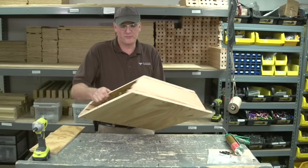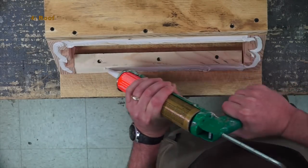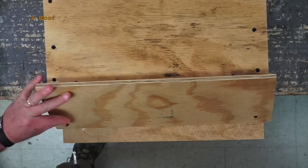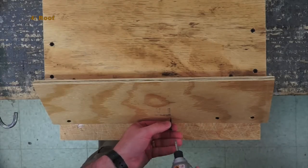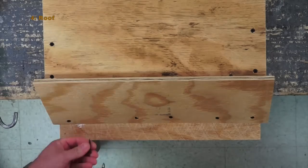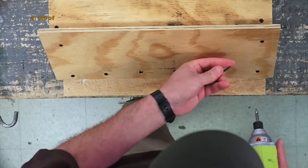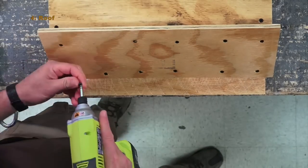Now I'm ready to install the roof. This is not a time to skimp on the caulking — we need this roof to be airtight so that the bat house retains heat. The idea is to have screws go into the back and pull the roof together tightly. Move the bat house so that it is hanging over the edge of your workbench in case a screw pokes out the back. If one does, just cut it off or hammer it flat rather than making another hole. Finish off the roof with 14 screws altogether — we need this many to prevent the roof from warping over time and breaking the heat seal.